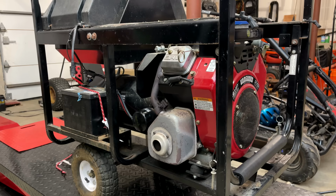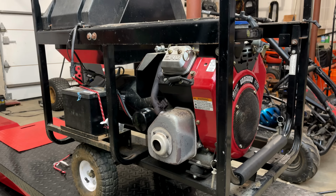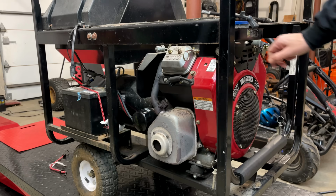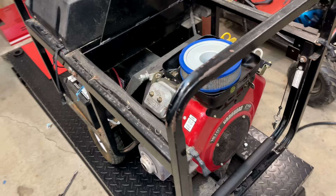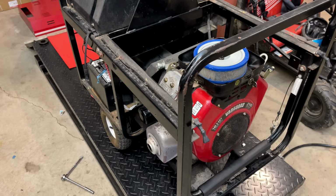All right, let's try it real quick. We'll see if we can turn the choke off. And that was it. Just a tiny little bit of debris in that pilot jet, and that's why the engine surged before. This time I was able to turn the choke off right away and the engine ran well. So taking that shortcut, I think, paid off.